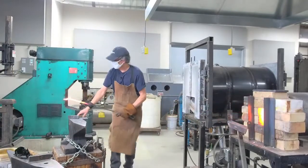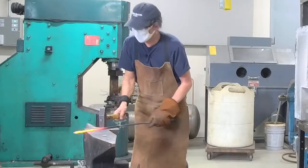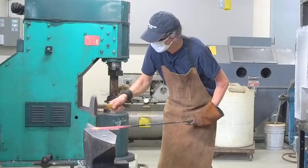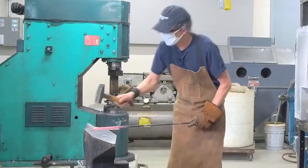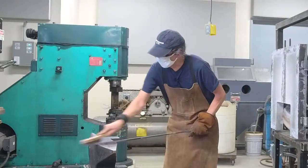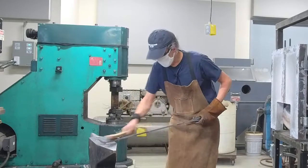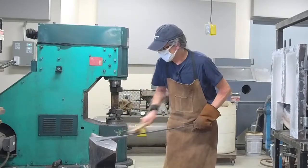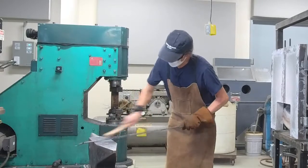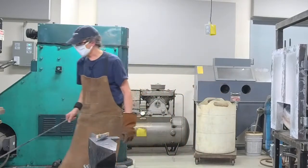Now I want to bring this end back and fine-tune the shape of it, then check for straightness again. To remove excess fire scale, clean it up — makes it look better, a little shinier, a nicer look. I've made and used a lot of them just like this and it's fine. But often to make it a little nicer I might paint it, sandblast it and paint it, wire brush and paint it, or brush it and put a traditional wax finish on it.